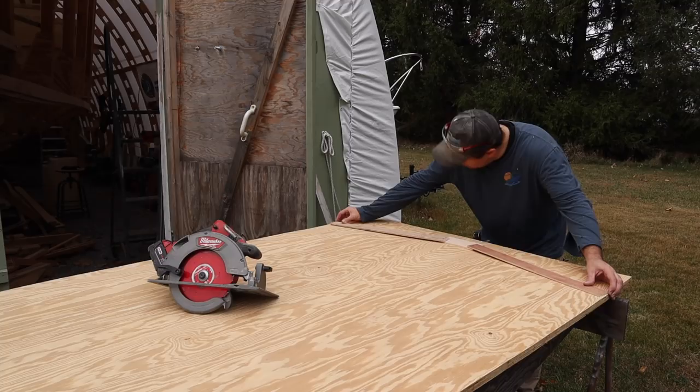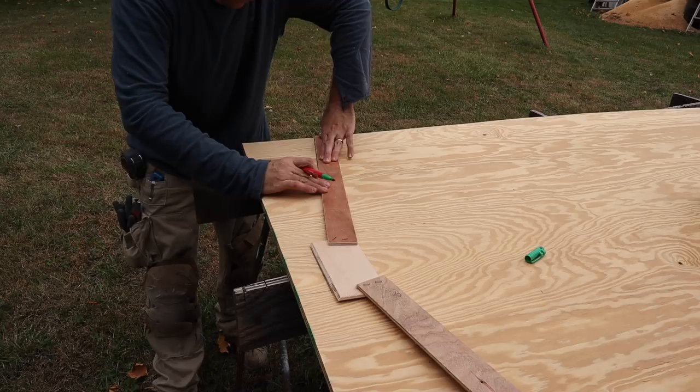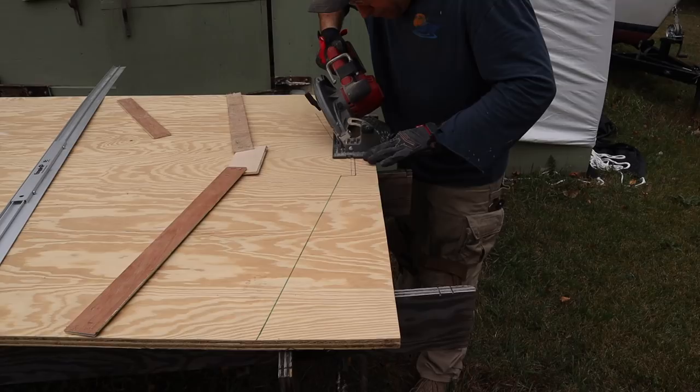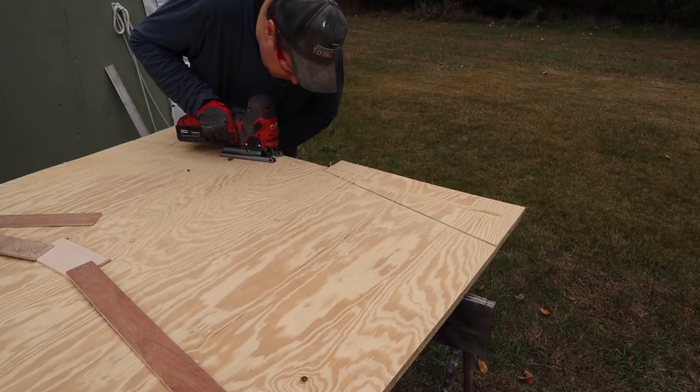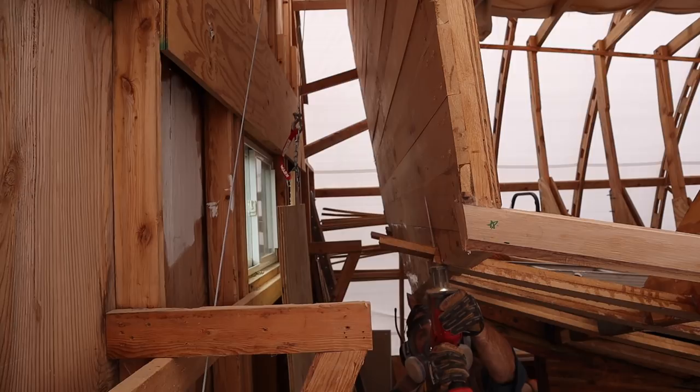The last big job on our punch list before we can start the side planking is to add another layer of plywood to the transom. Remember, our hull is composite planked, meaning that it's going to get a layer of standard traditional solid wood white oak planking followed by two layers of plywood. We already have the solid wood planking on the transom, and before we start side planking, I want to add another layer of plywood there. This will allow us, when we do the side planking, to let those solid wood planks run right past the end of the transom.